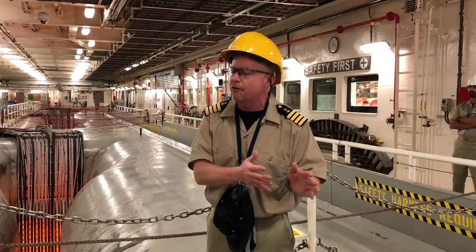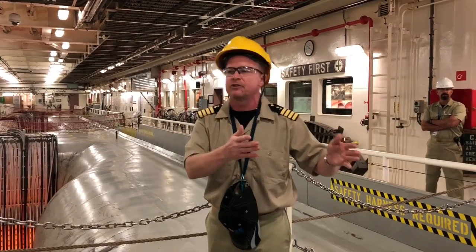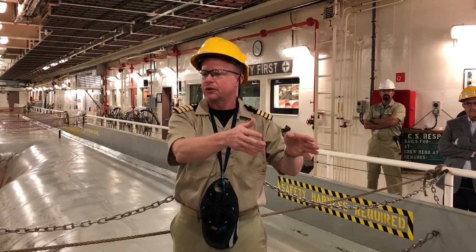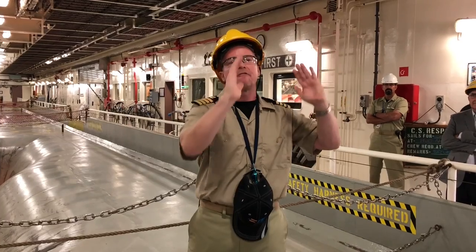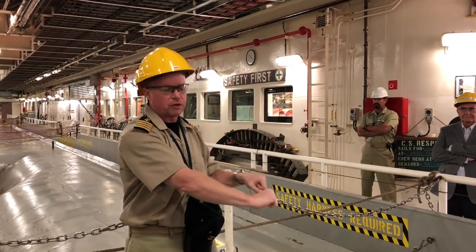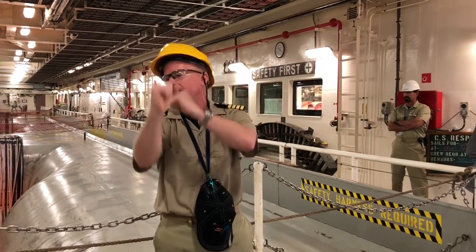So if we're in an area, and there are several on this route, that we need to plow it down and under, the only difference is we have this big plow on the stern. It's a 35-ton plow. It gets launched into the water, and it can bury up to 3 meters. We have an A-frame back there, it picks up, has the plow ready to go. Basically, all you're doing is grabbing this cable out of there, stopping it off, picking it up, and loading it up into this plow.